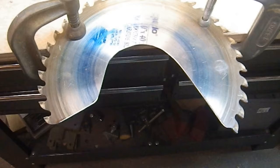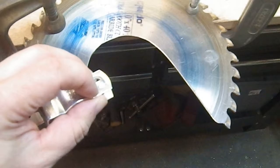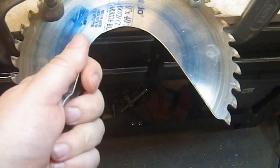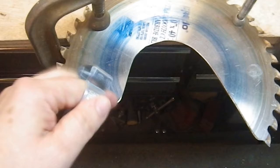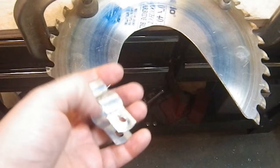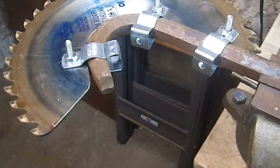Now it's going to be taking this off, putting the brackets, the blade, and the whole thing together into one component so I can lay out where I want the holes for the bolts to go. Drilling the holes is the last step, which is nice. The brackets don't come with nuts because the oddly-shaped hole acts as a nut, but I'm going to add nuts because I want a lot more clamping pressure than these things were originally intended for — conduit mounting against a wall doesn't need much force. I actually had to buy a box of quarter-20 nuts because I'd run out; I had more bolts than nuts.